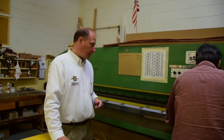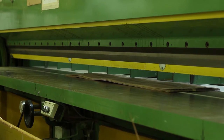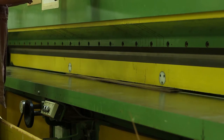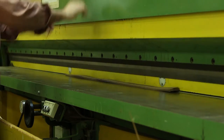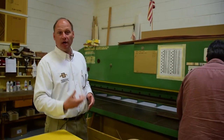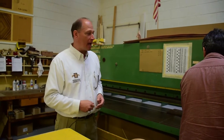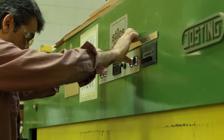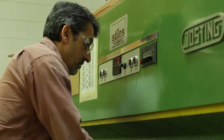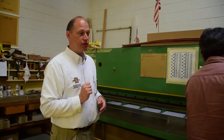The guillotine is trimming off all of the sapwood — the light colored wood. He'll trim out all of the defects, all of the mineral streaks. When a tree grows it actually physically takes minerals out of the soil and deposits them in the wood. A lot of folks won't cut those out — they consider those natural. We do, in order to create a more high quality product. We also use a guillotine rather than a saw. The problem with a saw blade is it wobbles a little bit, so you really don't get a nice tight seam in the veneer like you do with a guillotine.